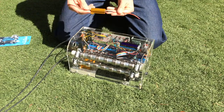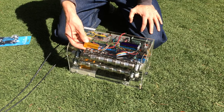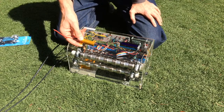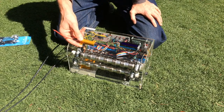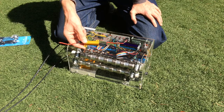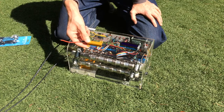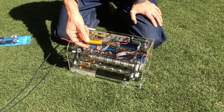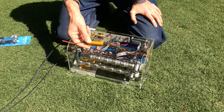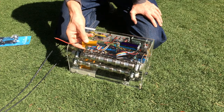The other load bank element is these 50-watt 6-ohm resistors used for some automotive purpose — I think I got them on Amazon. The purpose of these is for the low-current, low-power tail part of the curve, where you need more resistance to get greater separation between data points. They're also used at the beginning of the chain in cases where current is very low relative to voltage, to push those finer-grain data points out to the knee of the curve.